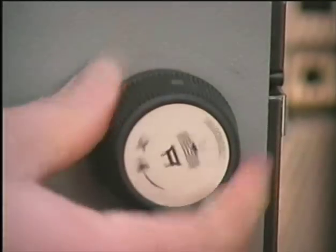For thin stock, it has to be set to the lower mark, and for thick stock, it needs to be set to the thick mark on the scale. You will find more helpful hints in the operating manual or in our leaflet, Hints for the Feeder.